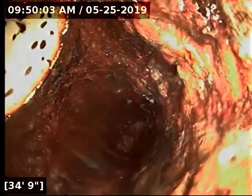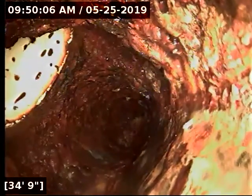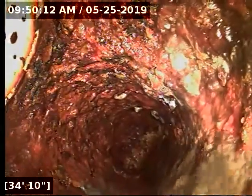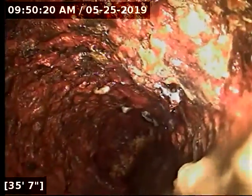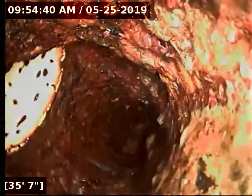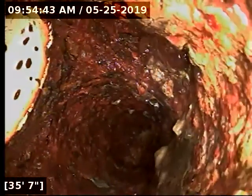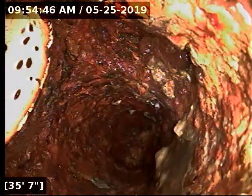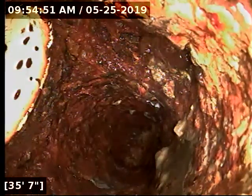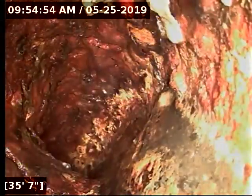A bit of home inspector here as well. There's a PVC cap on the cast iron drain line there. Right before we make a 90, let's see if I can figure out where that's at. I've put a blue flag right where that clean out is — that's exiting the left side of the house, the north side, and then we turn here.